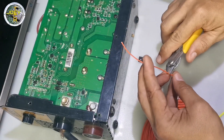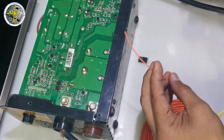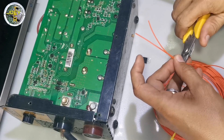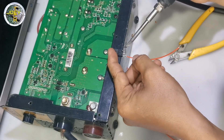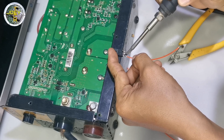I will disable the brownout protection by connecting pin 5 (ground) and pin 7 (BR) together. I'm now preparing wires for the pin extension and will solder five wires to the pins of the STRW6053N to connect it to the corresponding pins of the original switching regulator.